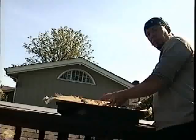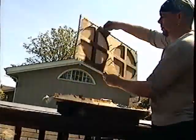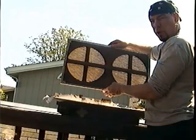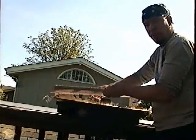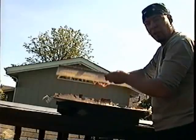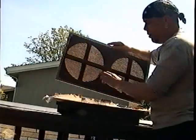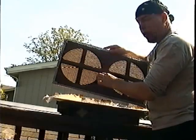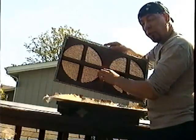Here's our grill out drying in the warm sun. As you can see, this grill is considerably cleaner. What I've done is take a tub full of warm soapy water and carefully submerge it for two minutes only, lifting it up and down, letting the soap suds run through the grill. The reason we don't do that for longer than two minutes is this is plywood — you do not want it soaking up a bunch of water. You have to do this really quick and get it right out into the warm sun to dry. I've had no problems doing this observing the two-minute limit.